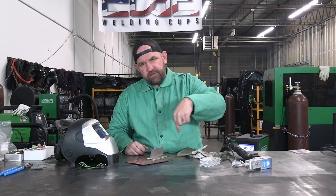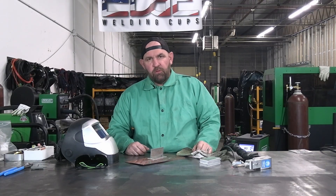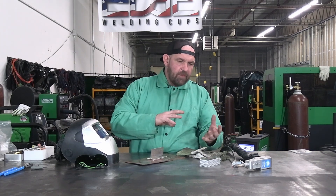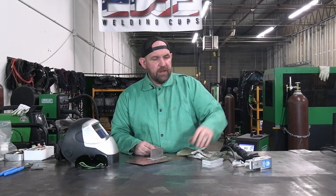So it'll actually do different laser shapes, like a D shape or an hourglass shape. A lot more powerful on the welding side as far as being able to control the way the laser scans and how fast it scans. So you can really fine-tune if you're doing gaps, if you're doing multiple passes — especially right now we're going to run some aluminum — just a lot more control over the scan.